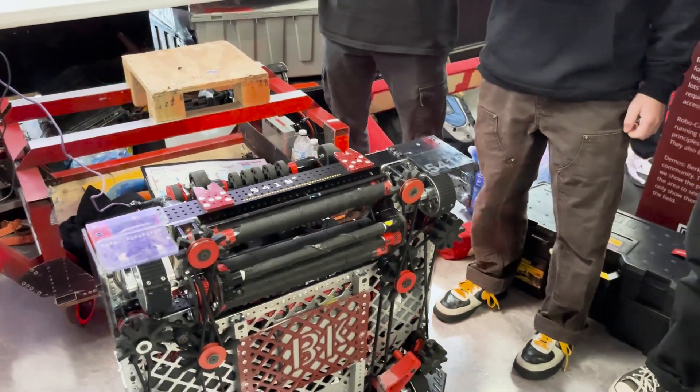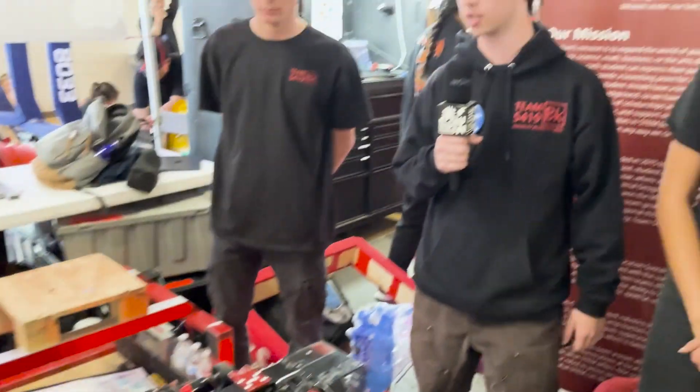This year we decided to spend a lot of time in software — it's the most complex robot Verkellium has built, partly because many subsystems are dependent on each other. We run three state machines: one for the intake chain, one for the arm and elevator kinematic chain, and a third that acts as an overseer — the boss of both — to keep everything running smoothly. A highlight of the automation is a full shoot-on-the-move feature: with one button the robot aims, moves the arm and elevator to the right position, spins the flywheel to the right speed, and shoots automatically when it deems fit.